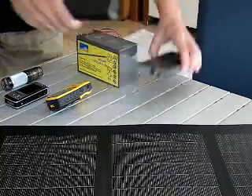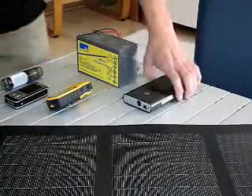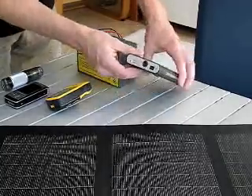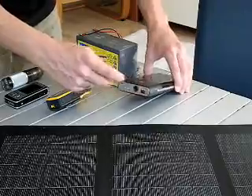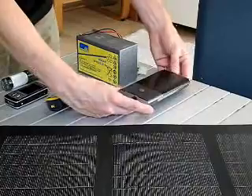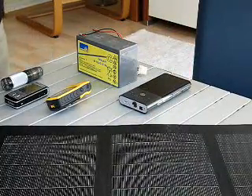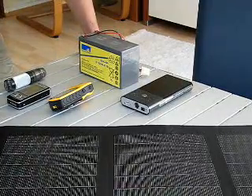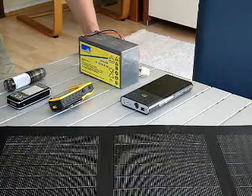I've got here an equivalent sized battery with charging circuitry integrated — a standalone battery pack, the MP3400 from Tablet Kiosk. It takes 56 watt hours of energy, 19 volts in, and various voltages out, so it's a fairly flexible little unit. The only problem is you have to supply a fairly steady 19 volts and at least 0.6 to 0.7 of an amp before it even starts charging.